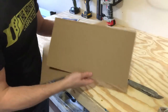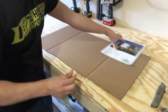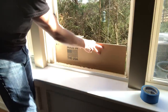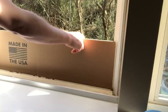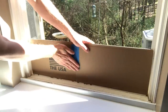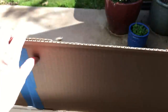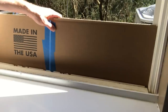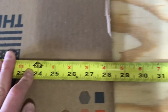Cut two narrow pieces that are smaller than your window width and make sure that the ends are square — you can use the corner of a magazine to check this. Set the pieces down in the screen track or behind the window screen flange and slide them to each side until they butt against the inner walls of the screen track. Once they're tight in that position, back them off just a little bit. Then tape the two pieces together where they overlap using painter's tape or duct tape. Now slide the conjoined cardboard pieces side to side again — you should have a little bit of play, but not so much that the cardboard falls out if pulled to one side. You want it to jostle a bit but stay in place. Now you've got a perfectly good cardboard mock-up of your screen width. Just lay it down, pull your tape from one edge of the cardboard and measure to the other. That's the width measurement you'll put in for your window order.